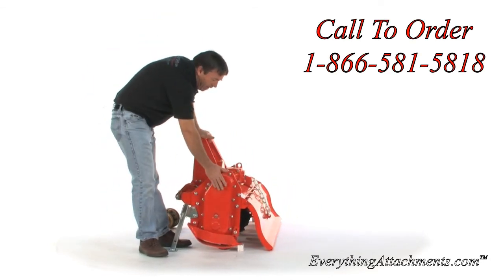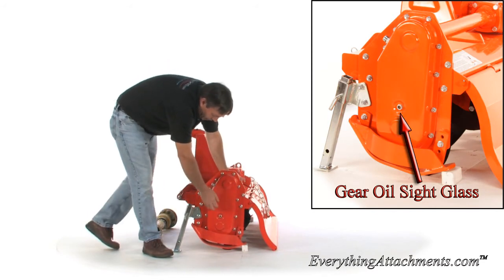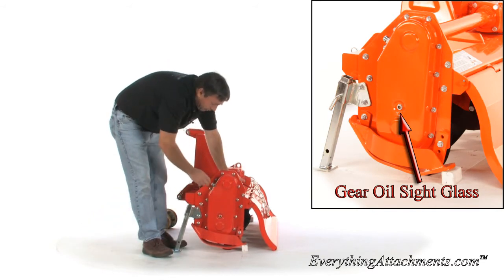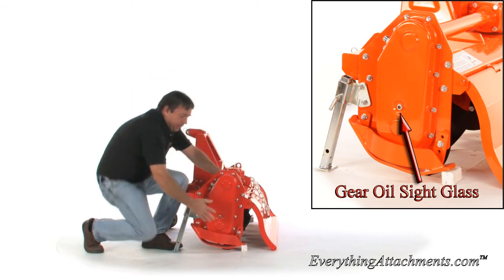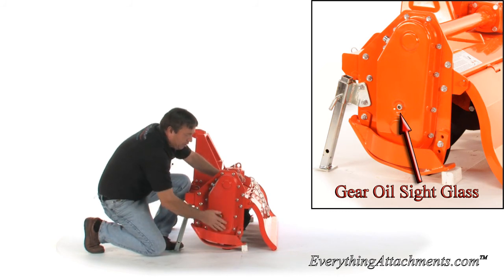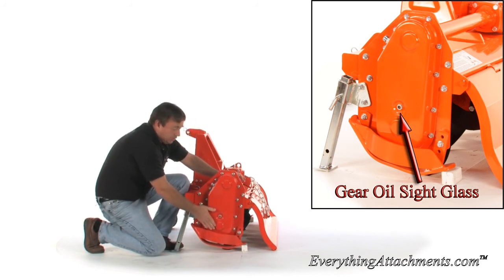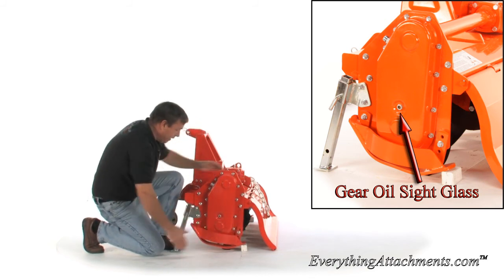Over here on the drive side, it has a heavy-duty chain running in oil with a self-tensioner inside of here, a vent at the top to let out the pressure as the oil gets warmer, and has a nice shield over here, so as you're dragging this through the dirt, it's not wearing on this case that's containing your oil. This side is also adjustable for your height.